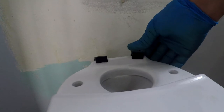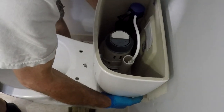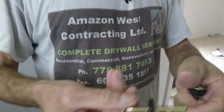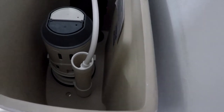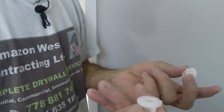Just put them in there — once the tank is on top, it's gonna be in place. Here we have this other seal on the screws. Just put it on the screws; it's to hold the top to the toilet bowl, and the seal is just to seal the water so there's no leak. You can see the hole in there — we're gonna make sure the hole is straight. This is just plastic, so usually hand tight is good enough.